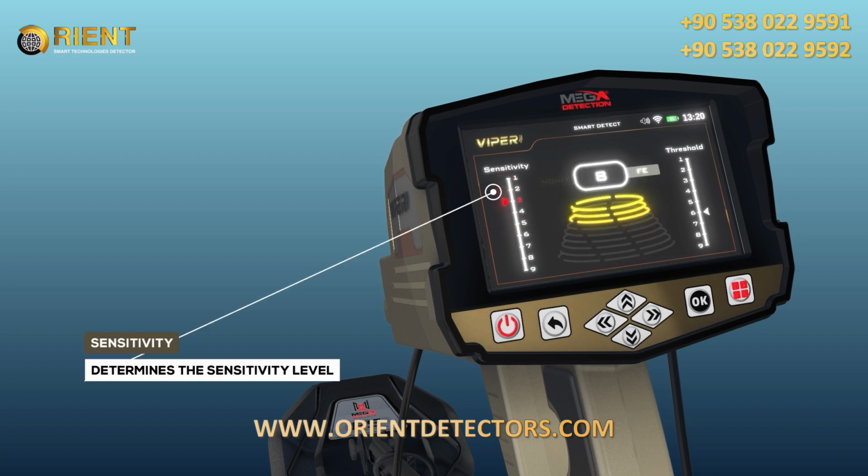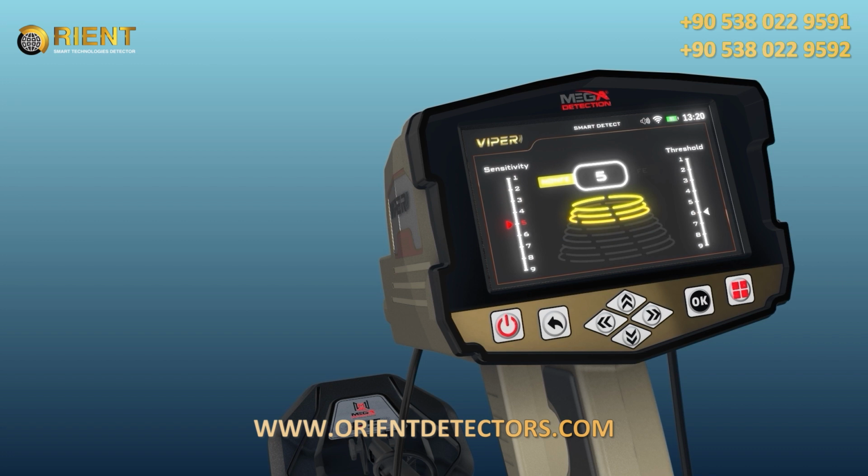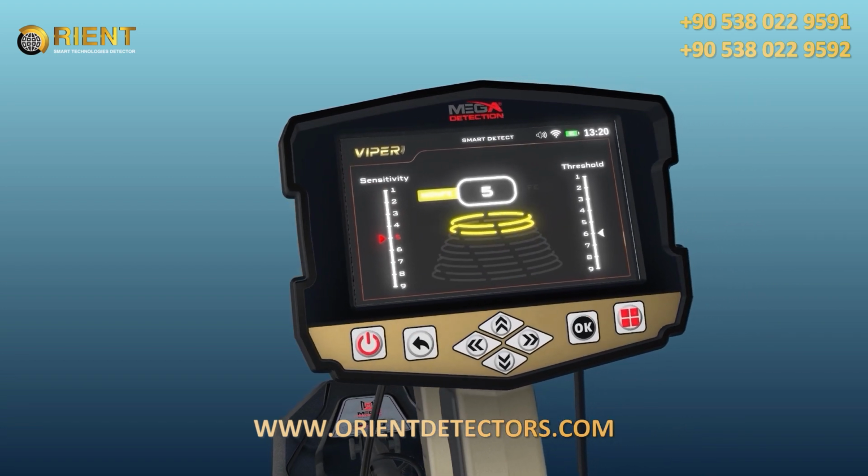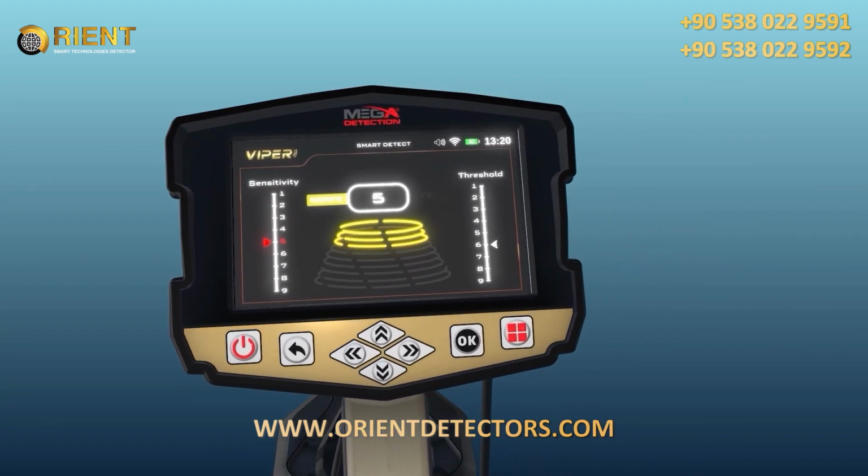Sensitivity. The left vertical indicator determines the sensitivity level, and the user can set it to one of 9 levels. The higher the sensitivity value, the greater the sensitivity of the search coil to detect small targets at greater depth. Their value can be dialed down gradually to eliminate unwanted sounds.